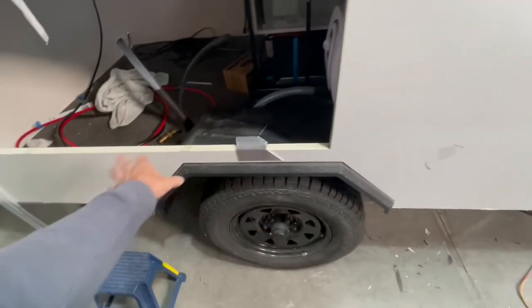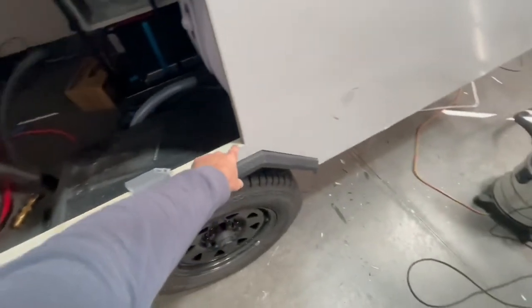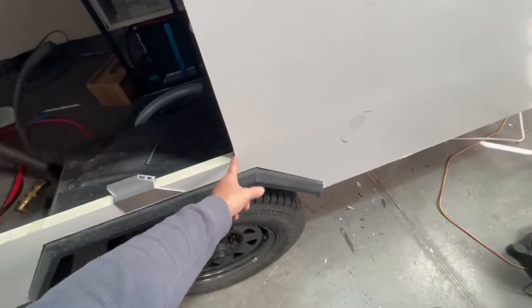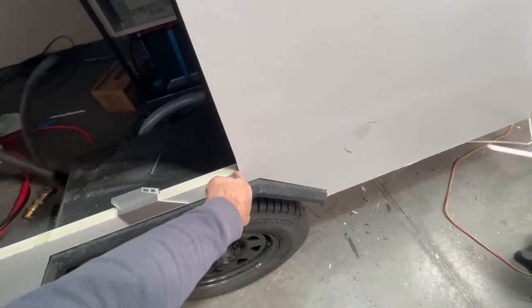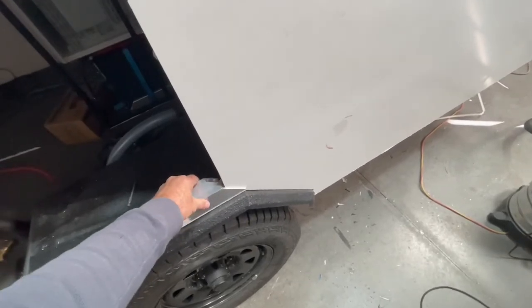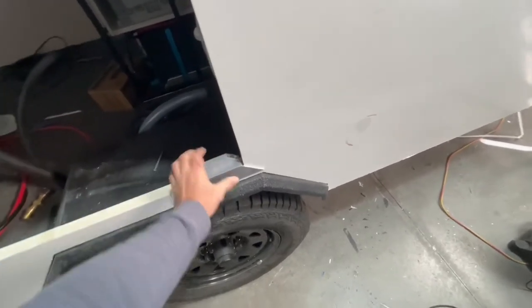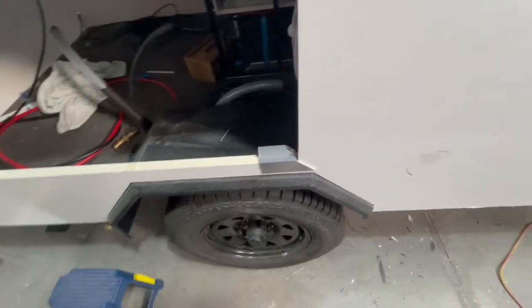I've got to get all those on and trim all these up because they've all got to be millimetre perfect. I want to make all these dead flat. I reckon that corner there where it's rounded from the router blade will need to be cut square so that when these mitres come in, they sit flush against the edge. So I've got to tidy all that up - a bit of work in that, obviously.